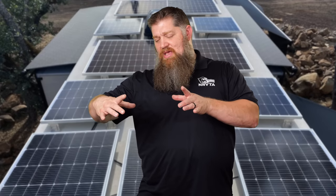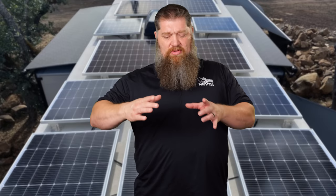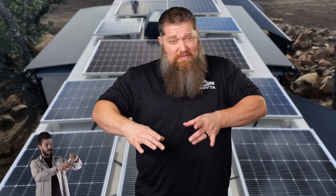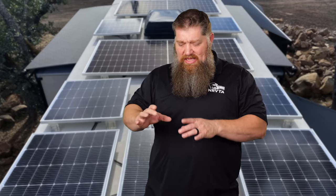The proper way to put solar panels up is no secret. We pre-measure everything and then pre-drill. If I know where my feet are going to go, I pre-drill the hole. Now I've got a hole that goes through that membrane — whether it's EPDM, TPO, fiberglass, or PVC. I'm also going to put some caulk in that hole, because when I drive the screw in, I want the screw to catch that caulk and go in there.